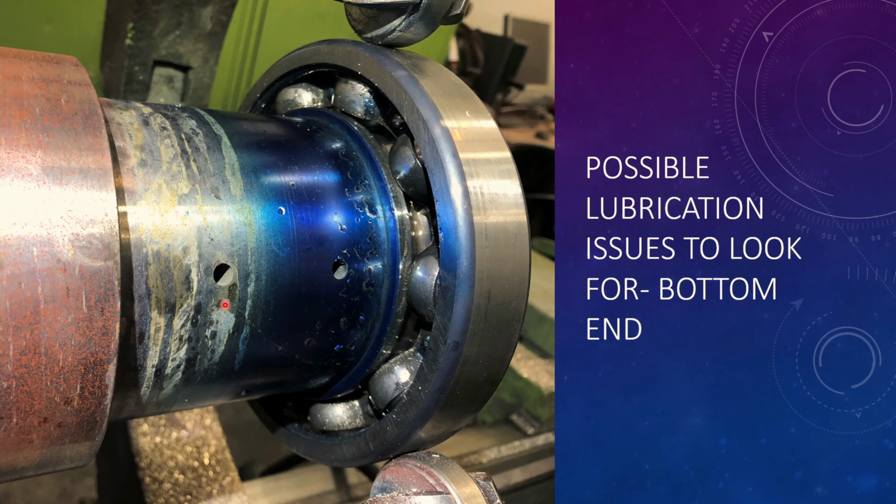That hole is for the bearing cap. When you're looking at the bearing cap on these, they have large standoffs that actually touch the outer race of the bearing. In the center of the bearing cap, they have a valley area that's machined out in the cap or casted in the cap. And the theory is that as the motor has any vacuum being formed by the fins rotating around the outside of the bearing cap, it's trying to suck oil out of the bearing cap.